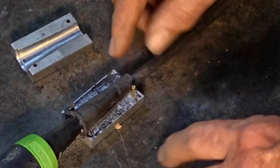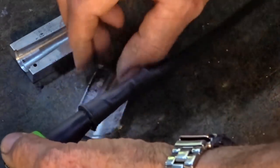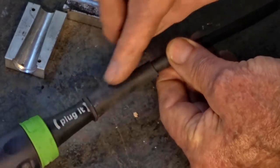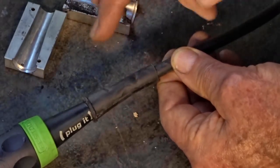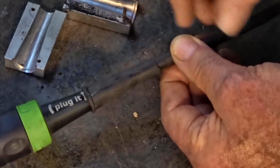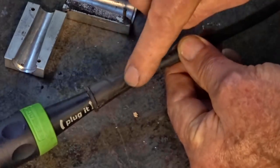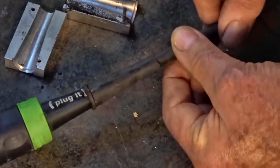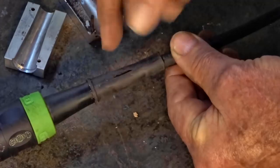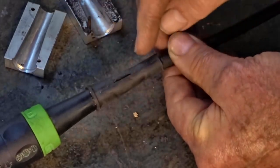So at the end of the day, what I decided to do is to just leave the die open, or actually remove the die altogether. I had to mold this center section back into shape manually. So I just got my finger, I wet it with some liquid soap, went over that, just smeared that back down to the correct shape. Now this side came out really perfect. This side here has got a couple little defects in it, but nothing major. And for some reason, there's a little tiny crease in this edge here. I'm not sure where that came from. I may not have had enough Sugru molded around that when I closed the die.